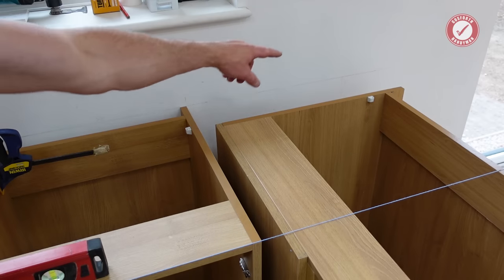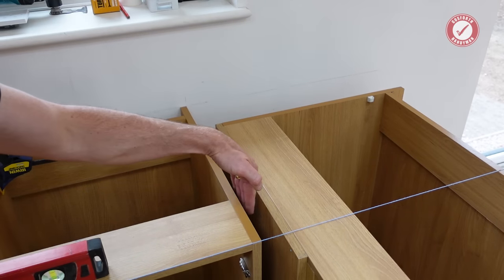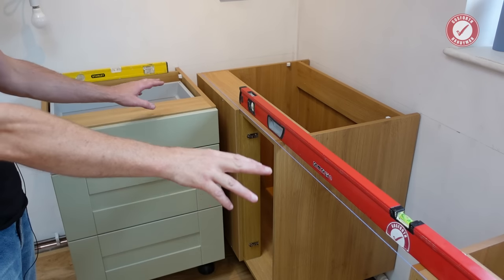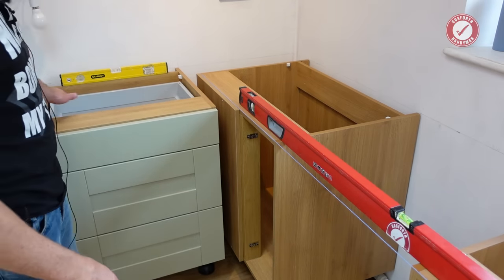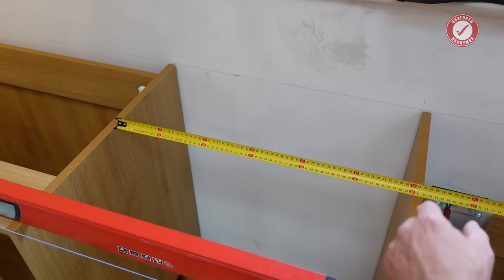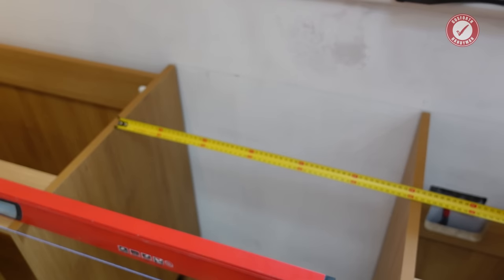Over on this side, they recommend a 130mm gap at the back and a 50mm gap here. Remember, this panel will come off and it'll move backwards and then it'll butt up to the corner trim. Obviously everything is perfectly level in every direction — I've checked all the way across the units at the back and all the way across. These are all absolutely bob on. And then the other thing is to get your spacing for the dishwasher correct. This has to be 600mm exactly. If you don't get that exactly right it's going to cause problems getting your door alignment correct later down the line.